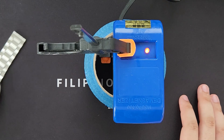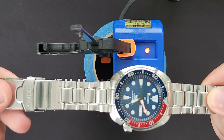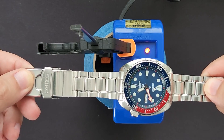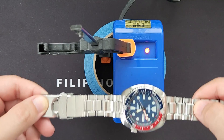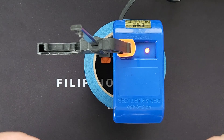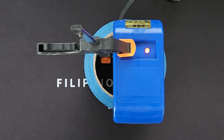We can now use the demagnetizer. Plug in the demagnetizer. Now place the watch right above the demagnetizing pad of the device. It is recommended that you remove any straps or braces from the watch to leave just the head, but if you are unable to do so, then holding the watch by the end of the strap should be fine. Hold down the red button and slowly lift the watch away from the device over a matter of 5 seconds. What we're doing here is dragging the watch away from a strong magnetic field to a weak magnetic field, which should decrease the severity of its magnetism from the changing orientations of alternating current. You may need to repeat this for a few more rounds given this type of budget-friendly demagnetizer.